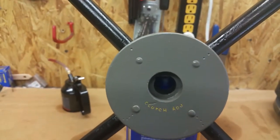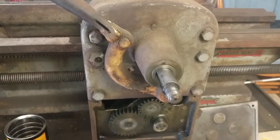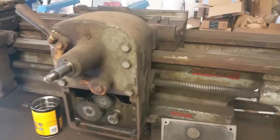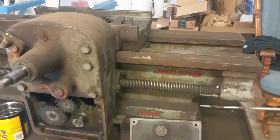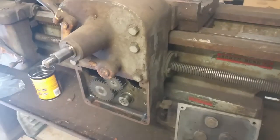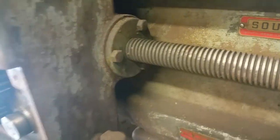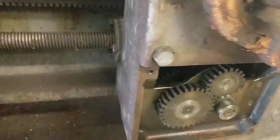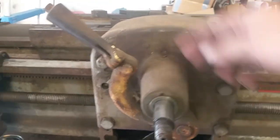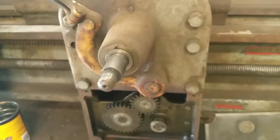The nut is also keyed on the shaft. We needed a hammer to knock it off — it doesn't just slip on there, it's on pretty snug. We got that knocked off and we're going to work on getting this apron off the main screw. Right now I'm doing some guesswork and exploratory surgery. I'm going to take the three bolts off here and see what's going on inside, as well as knock this handle off — it looks like we have a taper pin holding the handle to the shaft.